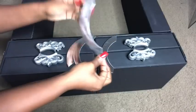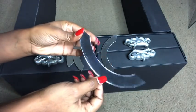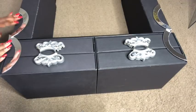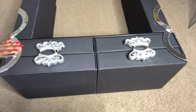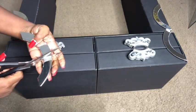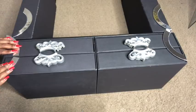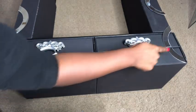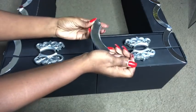I have a few cracks of my own but it's not much. If you have an obvious crack, just tilt the plate a little bit and it won't be noticeable. I'll be making use of these arcs to form a design on the table. For the arcs on top of the drawers I'll be cutting them into two to make it easy to open the drawer and still have the design on. To make sure all the arcs are uniform, I held them all together and cut them at both ends.